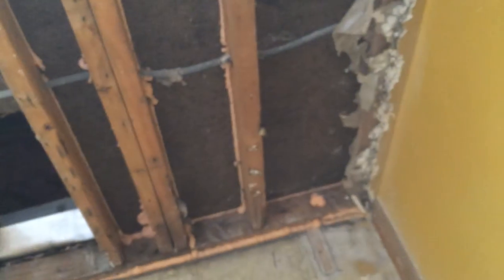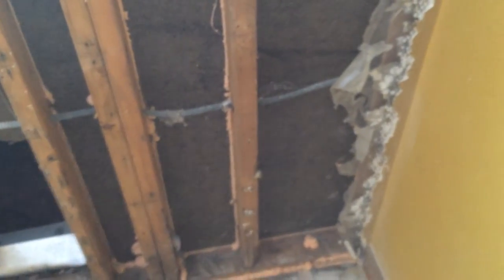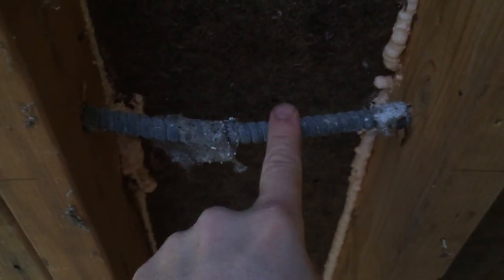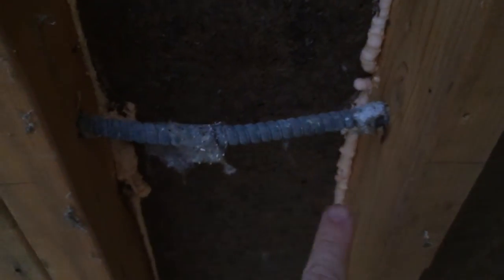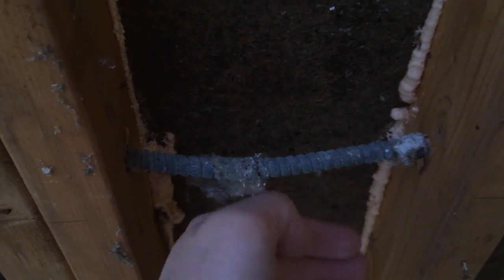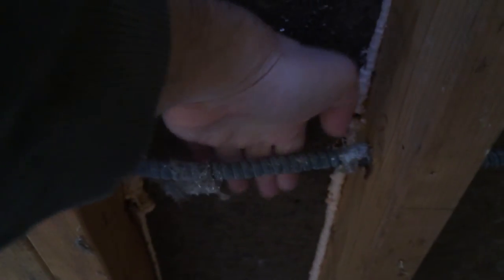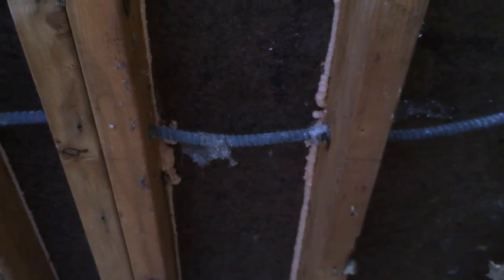Basically just go around all the studs, top and bottom plates, anything that comes through, any holes you can see — hit them. It doesn't take that long. As much as I don't necessarily love using fiberglass batts for this, it'll work fine because at least it's in a sealed cavity now. One big note: if you're going to use fiberglass batts and you've got wiring running through, split the fiberglass so you put a little bit behind and a little bit in front. Make sure you don't squash it. If you have a plumbing line running in there, make the plumbing line go behind so it doesn't freeze — otherwise it's a freeze risk.